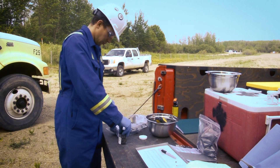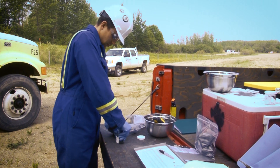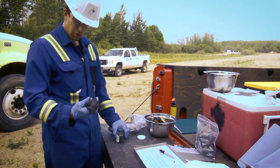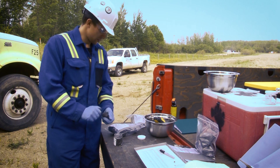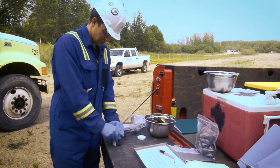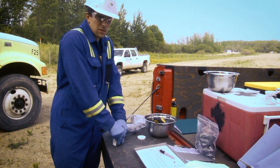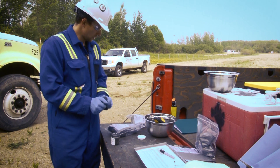Well, this is a sample from about 5.25 meters down. It's glacial till, it's already grey, so we're into the unoxidized zone. No evidence of iron staining, few pebbles. We're going down to 6 meters, but ideally this is a well install, so we'd like to have a little bit of water in the hole.